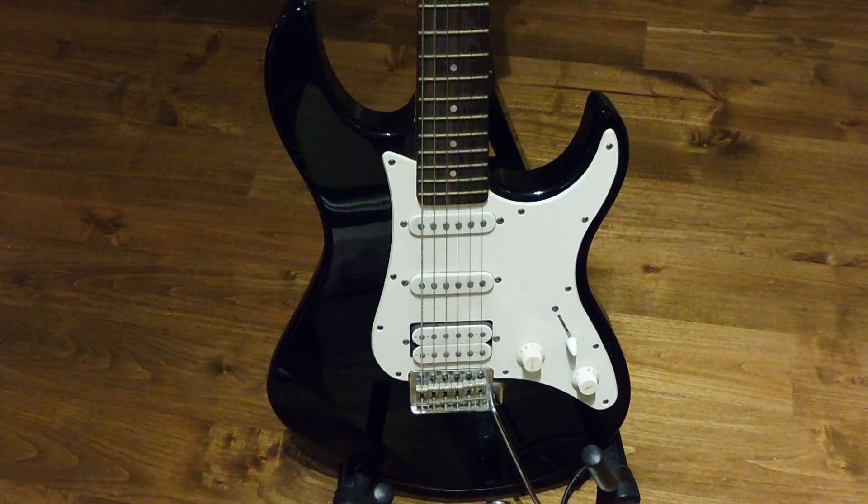This is the AC device I'm going to use in this video — my son's guitar; I don't play guitar. We have to measure the output impedance of the pickups on the guitar, then design our unity gain voltage follower op-amp circuit to be 10 times the output impedance of the pickup, so we don't load down the signal coming out of the guitar. I'll hook it up to the scope and calculate the output impedance.